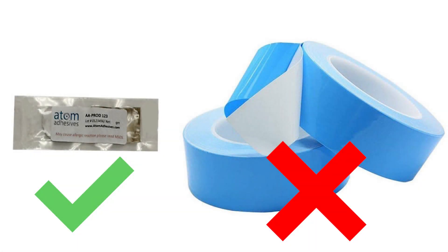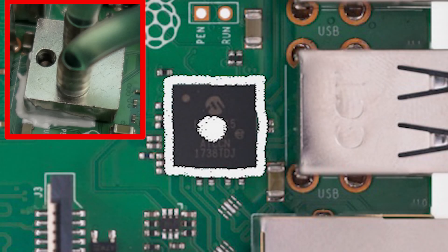When attaching the cooling blocks to the Raspberry Pi, I opted to use thermal glue rather than thermal tape. The reason I didn't go with thermal tape is that it doesn't have the hold necessary to keep the blocks attached to the components over a long period of time — I wanted something more permanent. Gluing the USB and ethernet cooling block was pretty easy: just a dab in the middle and around the outer perimeter, push it on, let it sit.